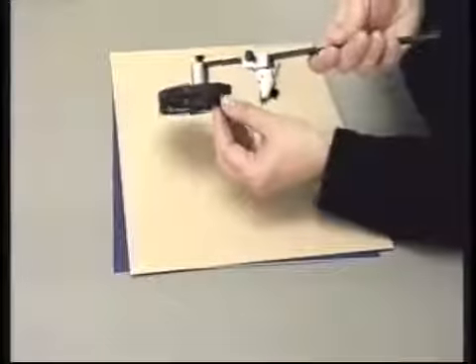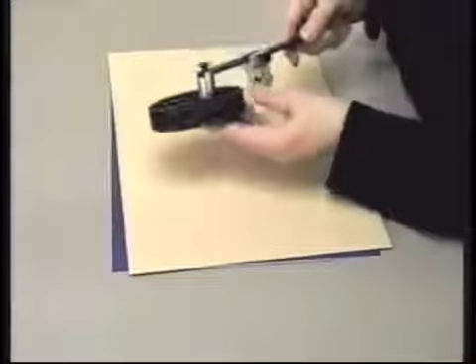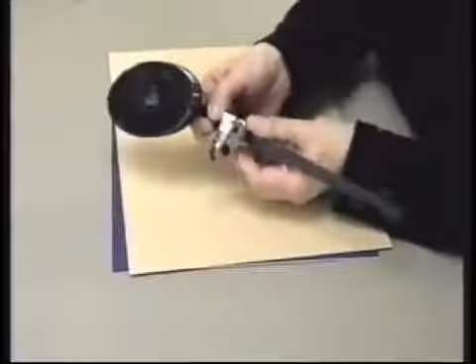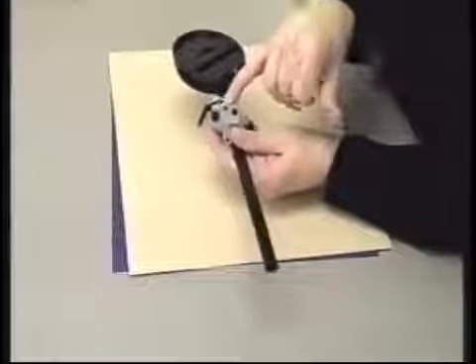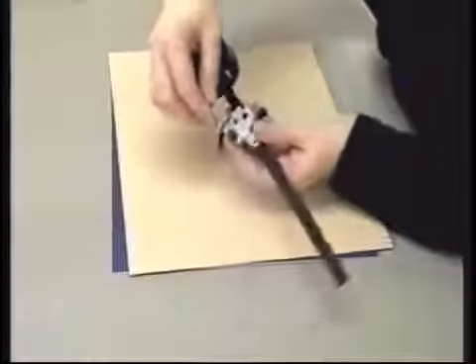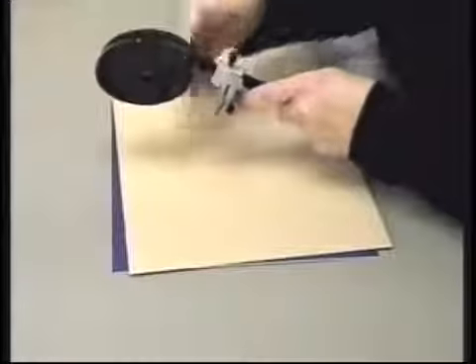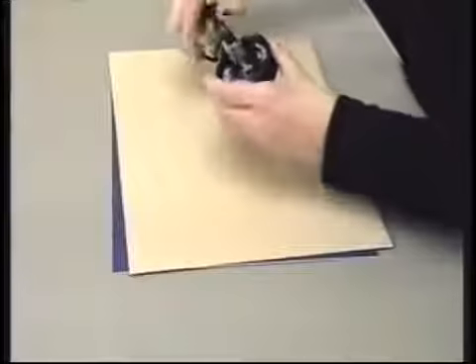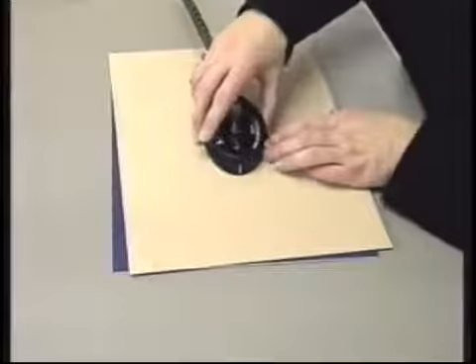This has four little white marks on it, and these have to be lined up with your pencil marks that are in the center of the board. The cutting head right here rides on this arm, and the blade sits right here. The blade is protected by this little wheel, and this lever is going to be used three times to allow the blade to penetrate the board just a little bit at a time. Right now it's in the position to protect the blade so it won't get into the board yet.